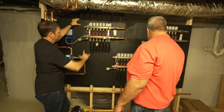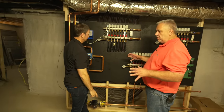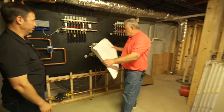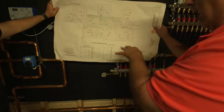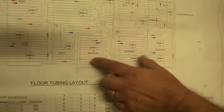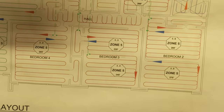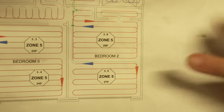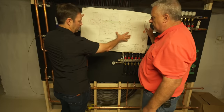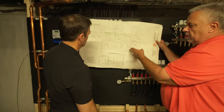When the thermostat says give me some more heat, it's going to open up the three loops for zone one and heat that particular bedroom or area. When you look at the WarmBoard plan, you can see the front of the house — these three bedrooms, because they're the same orientation, are all zone five, all on the same temperature. You can see the different loop lengths: 3.6, 3.5 — different loops inside that zone. All have one thermostat, basically going to be one temperature.